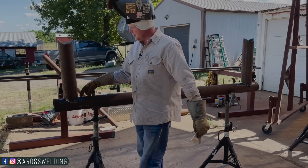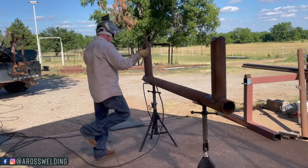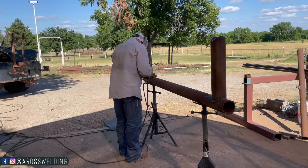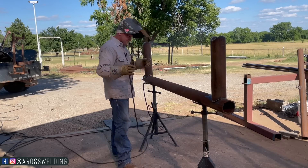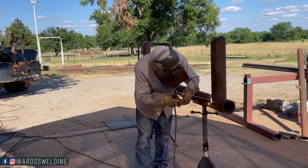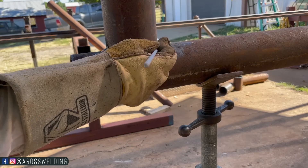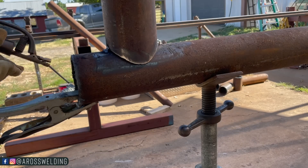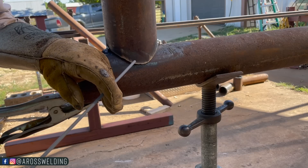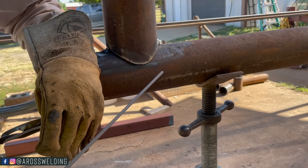I have a strange feeling it's going to be magnetized because of these shavings stuck on the end. A little bit — not bad, but it is a little bit. When I get on some pipe that's a little bit magnetized, tacking it with 7018 is a little more difficult. So I like to take my 5/32 8010, or 6010 will work also. Keep it on the same heat I had my 3/32 on — I'm on the 150 range on my left knob on my SAE 300, and then on my fine current I'm on 55.